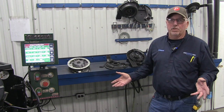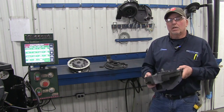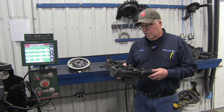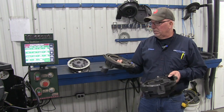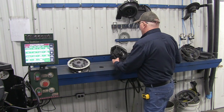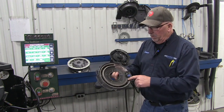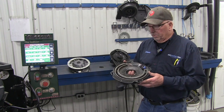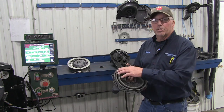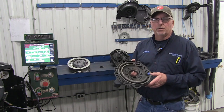The next type of meter is a vacuum meter. There are countless different brands of those, and we test pretty well all of them. Most people think there's not a lot of maintenance to do to a vacuum meter, which is true, but there are a few things to look for. One of the big things we're seeing the last few years is people running them too many years and the seal on the back cracking. In this particular meter, this is a seal. If you're planting away and everything's good and all of a sudden one row goes away, odds are your seal could be damaged. Once your seal is damaged, the vacuum goes away and your meter cannot perform.